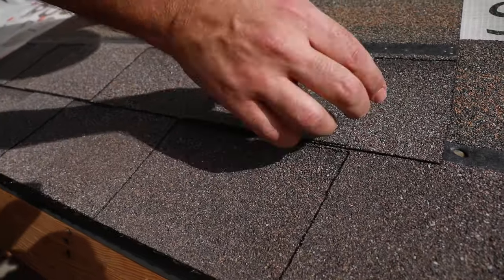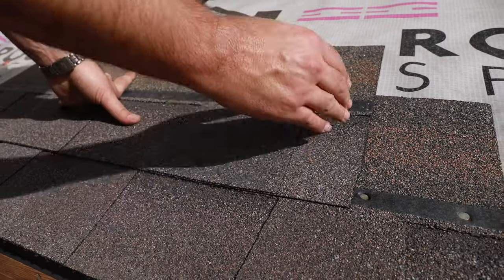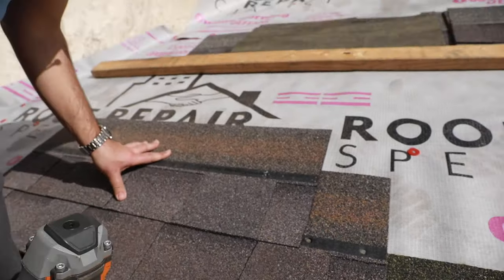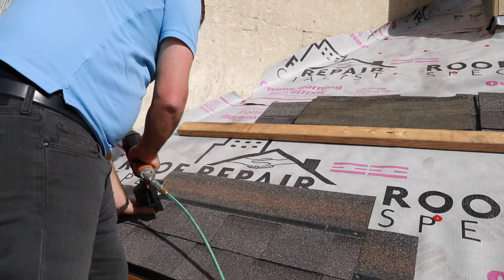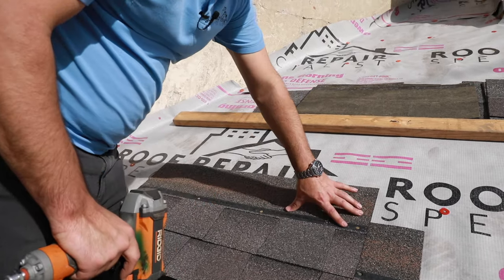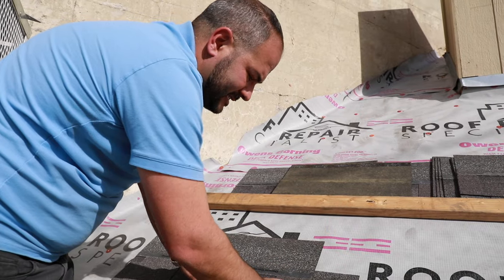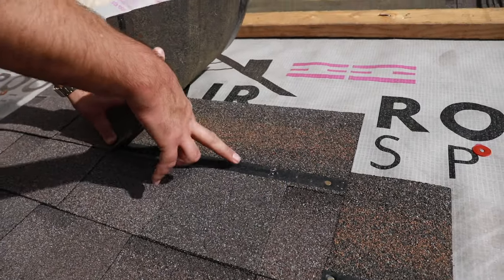You want to make sure that this top shingle is flush with the lower one and flush at the ends. When cutting your shingles, always make sure the cut end is on the inside of your roof and not on the rake end, because the rake end is exposed and needs to look nice. When installing, place one nail about an inch from each side, then go 12 inches in. The reason for that 12-inch spacing is so you don't have a nail in the joint cavity when installing your third shingle. The 12-inch spacing ensures no nail sits in that gap.